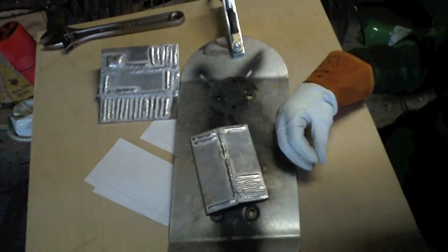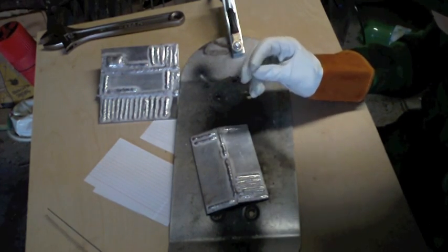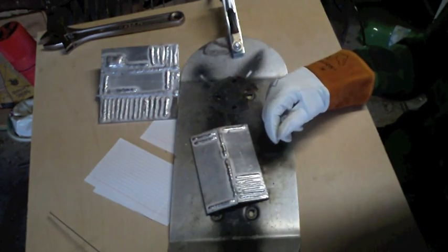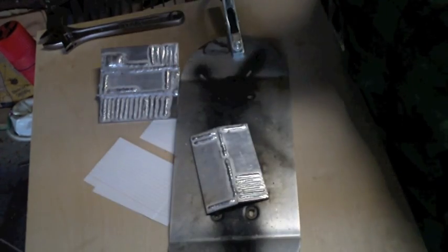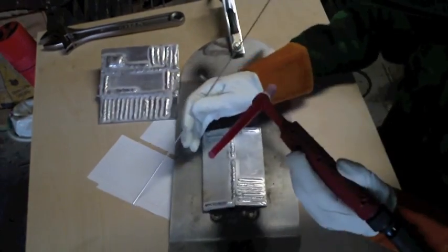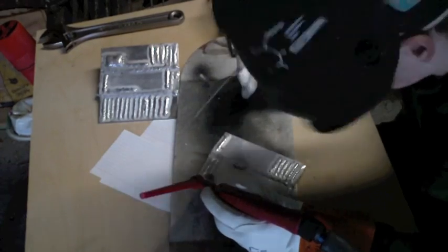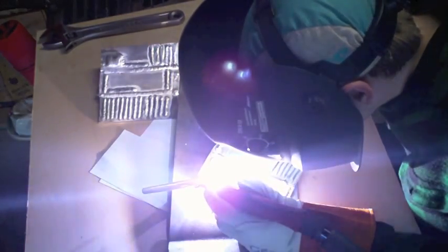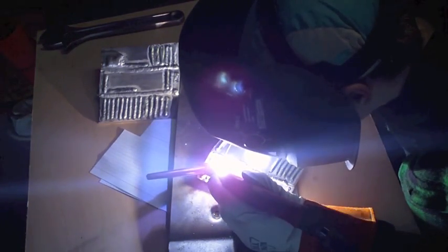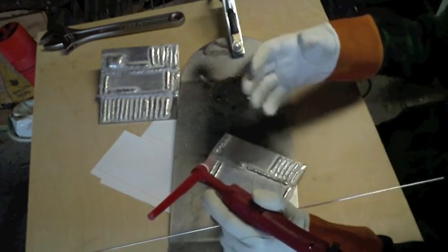So that's a quick overview. I have AC balance at about 30-40% and AC frequency at about 120Hz. If I change the AC frequency up to about 200Hz, you'll hear a difference — it's going to be a lot higher pitched. And the puddle is going to act a lot differently too. The higher the AC frequency, the more concentrated the puddle is going to be.